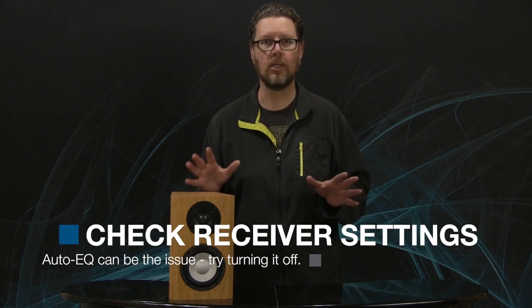If you're actually hearing sibilance on the majority of music, or even on dialogue playing back on your system, there are things you can check to see if something's set up wrong. First, if you're using a home theater receiver or AVR with auto EQ set — whether it's Audyssey or any other system — try turning that off. In many cases those auto EQ systems will actually mess up a good loudspeaker's amplitude response, boosting and cutting based on where the measurement microphone was placed, when in reality leaving the speaker unequalized would give you better performance.